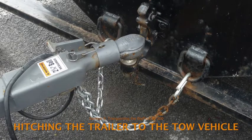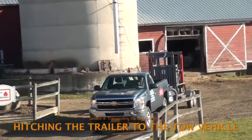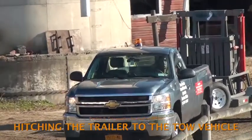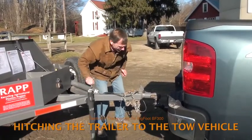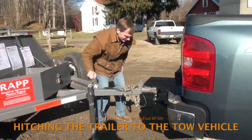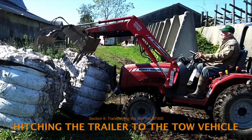Once the trailer is hitched to the tow vehicle, it does not need to be unhitched to use the baler. The manufacturer recommends that the baler remains hitched while baling, and Wrapp staff recommends this as well. The tow vehicle provides stability and support and prevents the trailer from rolling. If the unit is unhitched, the trailer jack is the sole source of support and cannot provide the same stability as the truck. There is a great deal of lateral stress on the jack if the trailer should begin to roll, when the trailer bed is lowered, or if the baler is jostled by a forklift or other machinery as might happen when the finished bale is being moved out of the way.